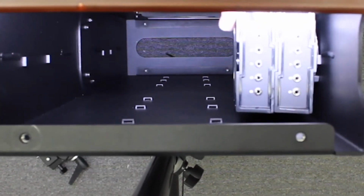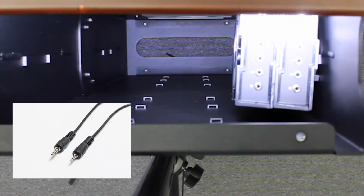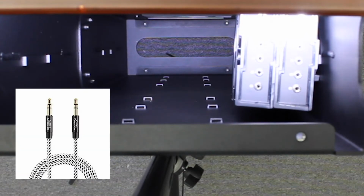So on the Esper boxes themselves, there are 6 ports, ports 1 through 5 on the first one, which is the one touching the left side of the booth. Those are going to be used for the sync ports, and then port 6 is going to be used for the flash. Ports 1 through 5 are using 2.5 millimeter to 3.5 millimeter ends. And then port 6 is a 3.5 to 3.5 millimeter aux cord.